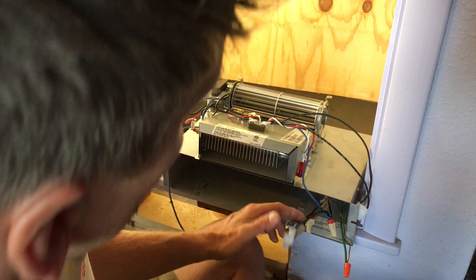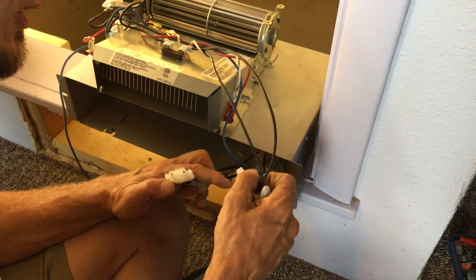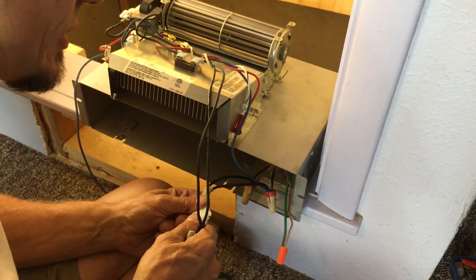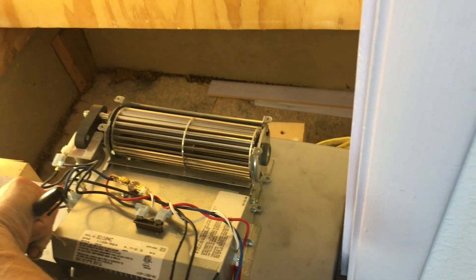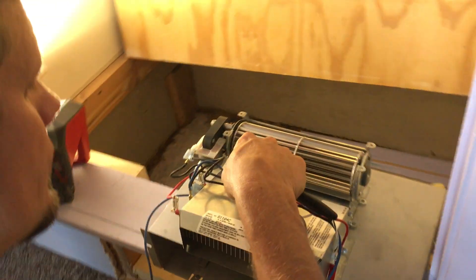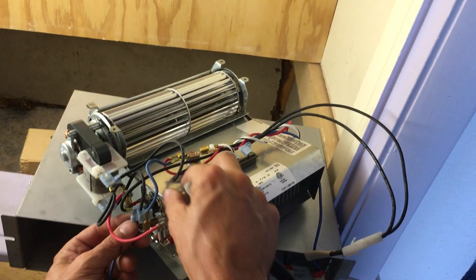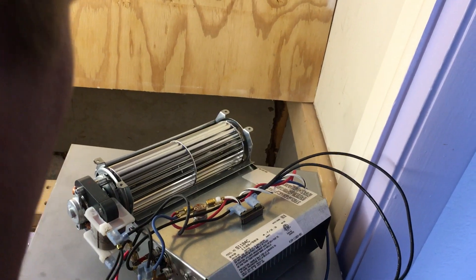Power will come up and go two ways. This harness is actually a bit monkey-proof because it has a slide on it. When you slide it, the power coming in here is going through the thermal fuse to check, to the motor, then it goes down into your element to heat. The other side of the blue comes across the thermal fuse and down to the other element. Don't worry about this blue — it's capped. You just cut it off and cap it.